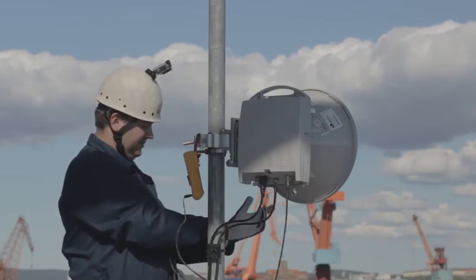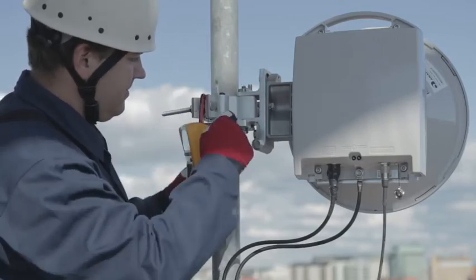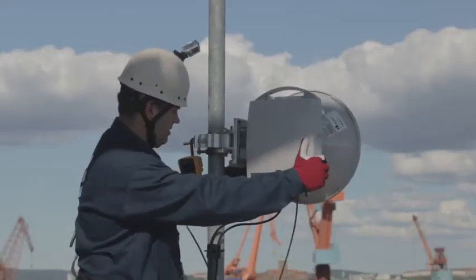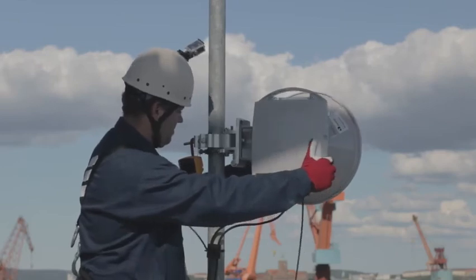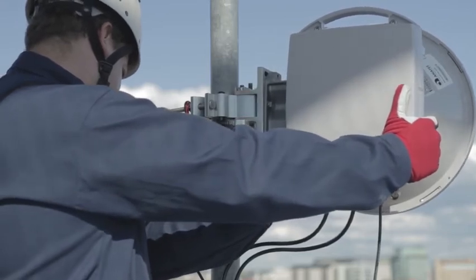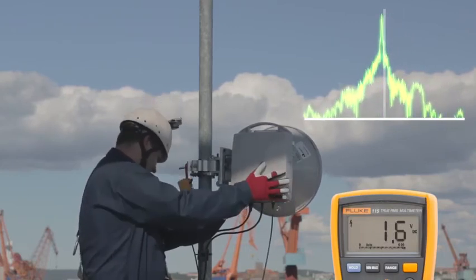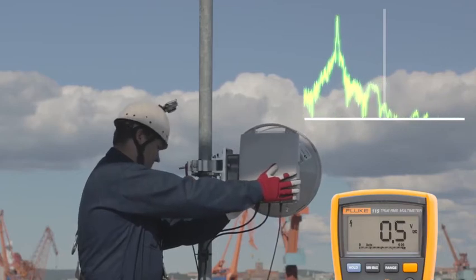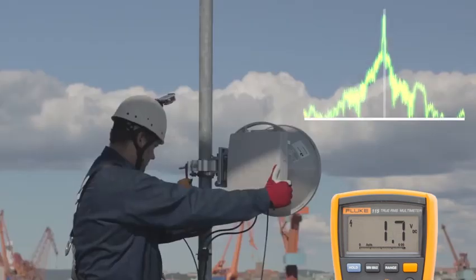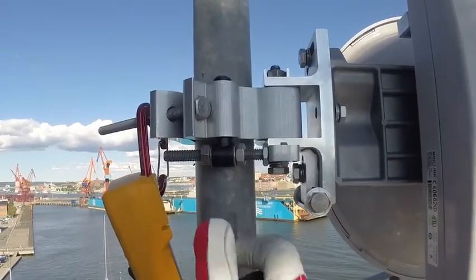Begin the alignment with the azimuth direction. This antenna has an azimuth adjuster with two nuts — completely loosen them so the antenna can be moved over the full range, left to right. Start at either the left or the right endpoint and turn the antenna slowly all the way to the other endpoint while closely observing the voltmeter. It is important to find the maximum voltage — the main lobe. Remember the maximum reading and the approximate direction. Turn the antenna slowly back until you find the main lobe again, then tighten the two azimuth adjuster nuts to prevent the antenna from moving away from the found azimuth direction.